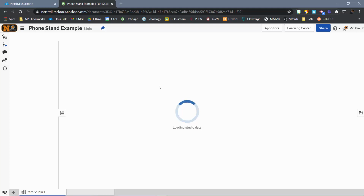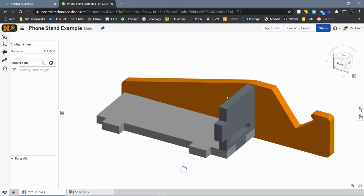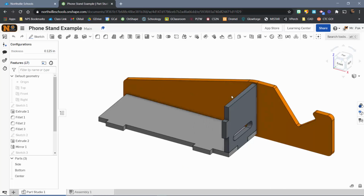So the way the laser works is kind of burning that material. So the higher the power, obviously the higher the temperatures essentially. And then speed-wise, if you keep it slower, the longer it burns, then the further it'll cut through, right? So it can also engrave, and so there's kind of a couple nice features there.